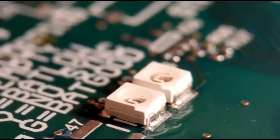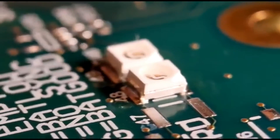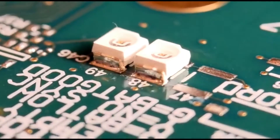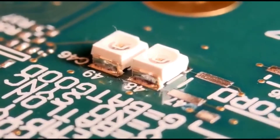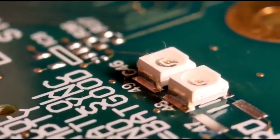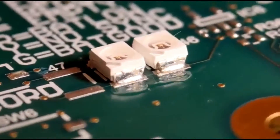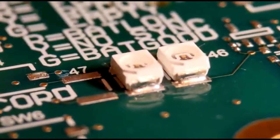So that's the two plastic body LEDs on — you've got a nice fillet on both front and back. There are the two joints at the front; turning it around to the back you can see a nice fillet of solder right around the back with no damage to the plastic body. The main thing is: if you hold your iron on these too long, the plastic starts to blister. I'm just going to lay an LED on there to show you how easily the body melts.